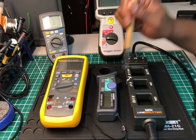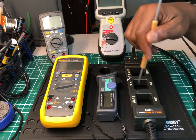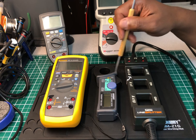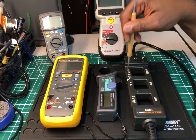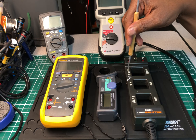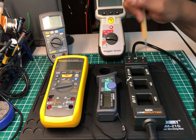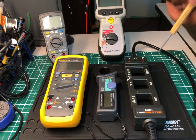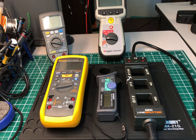This one here is sold under HT Instruments — I believe they may be the manufacturer. This meter helps me troubleshoot by putting the clamp around a single wire just outside the meter to test for milliamps of leakage current. These two devices — the Fluke 1587 and this leakage current tester — go hand in hand. Both are game changers for me; they've made my job much, much easier, and that's the qualification I use to call them game changers.